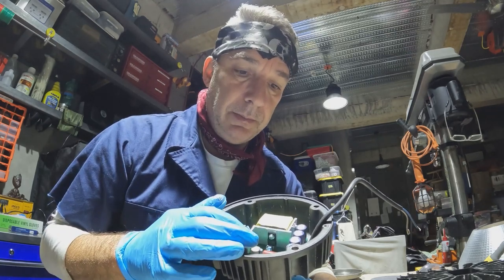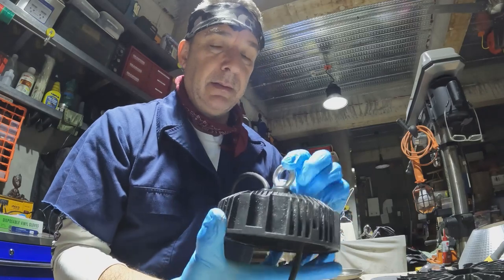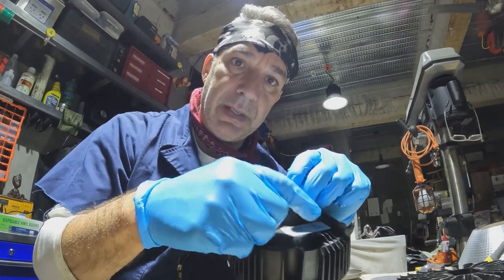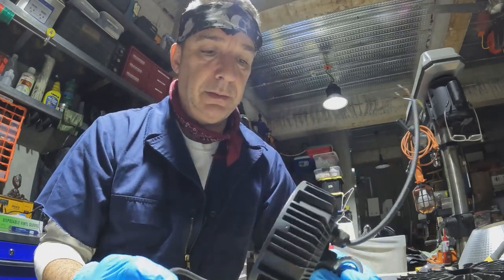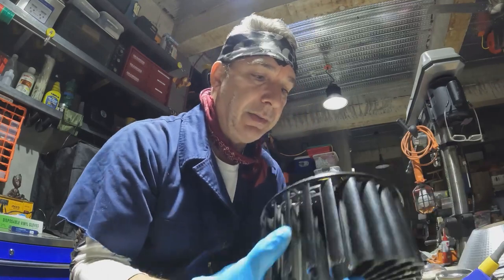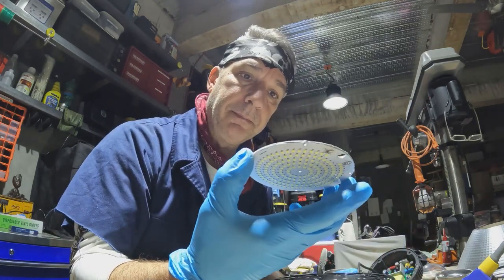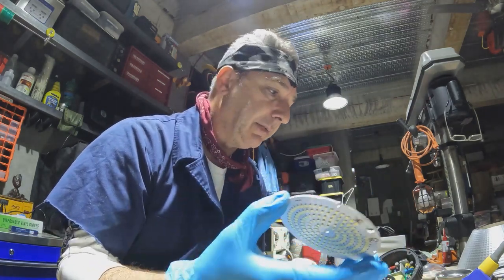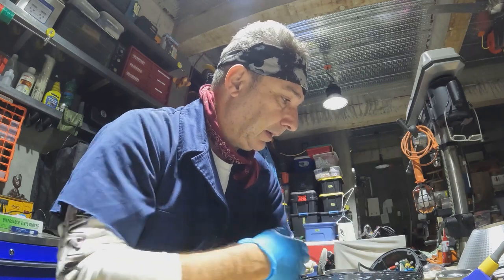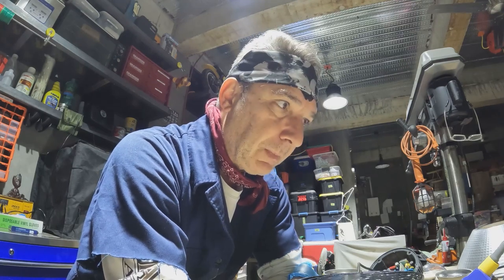So what I'm going to do is, I'm not going to reinstall any silicone, and in fact, because it hangs like this, I might drill some cooling holes in the top to let some of that heat escape from the driver area. So what I think I'm going to do now is clean up the original chip, clean all that old conductive grease off, and then strip the paint off of the heat sink. Then reinstall everything and resolder the connection and see what happens.